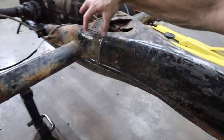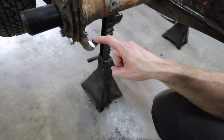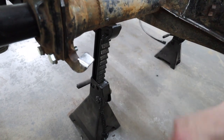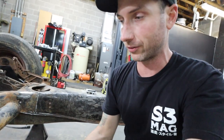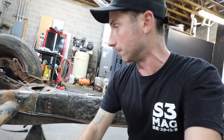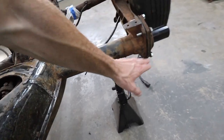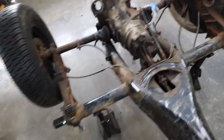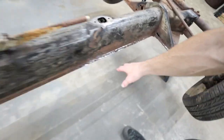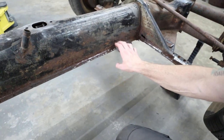I've got the back part of the outrigger flange cleaned up on both sides, and most importantly I got these cast support dropouts cleaned up and was able to save both of them without them breaking. They are cast and I've heard about a lot of these breaking — seen people make new ones and weld onto them. They help support the outrigger at the outer part of the pan, so without them there would be nothing else to hold the weight of the floor pan. Because this area is so rusty, I'm going to combine plug welding and 3M black panel bond.